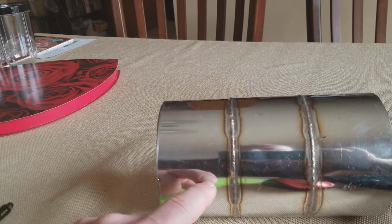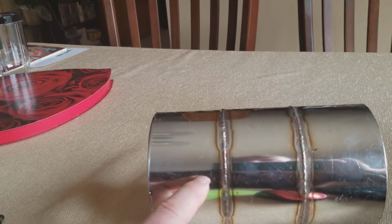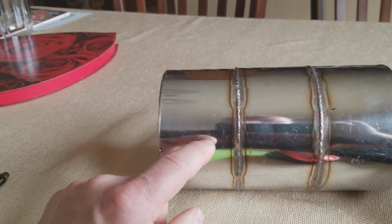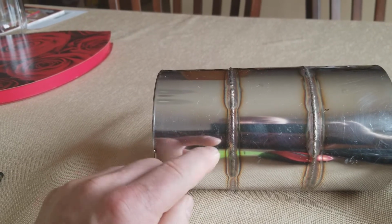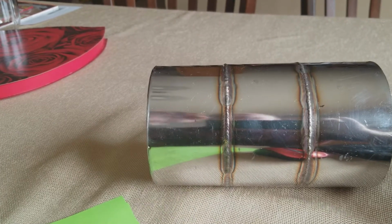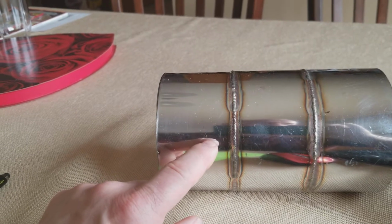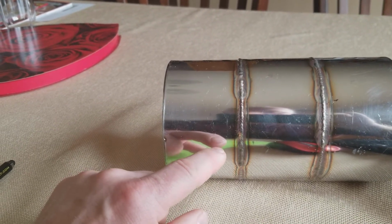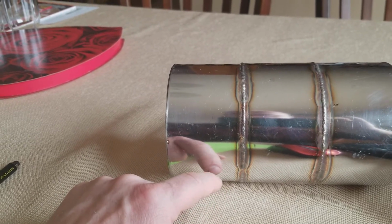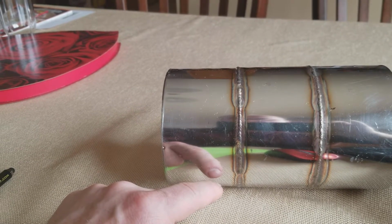and then I ended up picking up a total of 7 points. So I picked up 70 millimeters up, 135 millimeters up, 150, and each time I went until I saw a slight chip. A little chip started. So also don't assume that the bottom numbers are going to be the same as the top numbers with regard to where the Z is. Definitely go down below and touch off those.